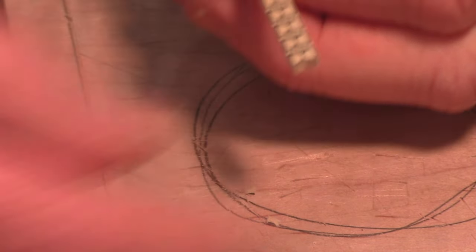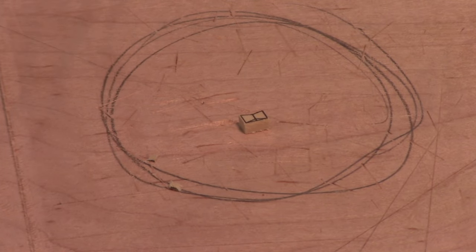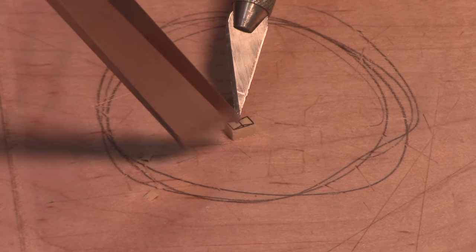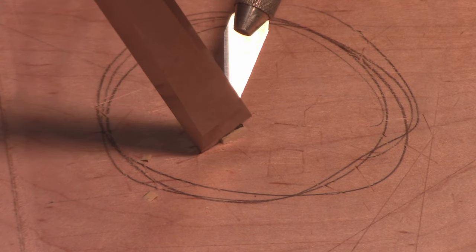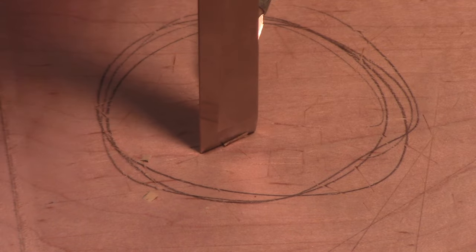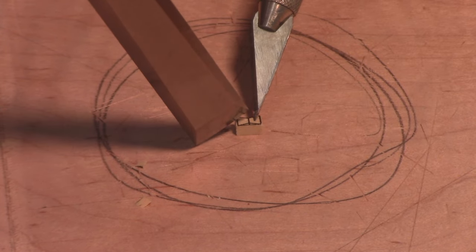So I've cut the notch. Now I'm going to take this to my trim board. Now I have a small piece of holly and there's no way I'm going to hold this with my finger, so what I like to do is take the point of an exacto knife — it can be whatever you choose. I'll repeat the process here, moving the piece around. I'll anchor the chisel in the hardwood and go across just like I did on the other side, point to point. Then I'll shear that off point to point and repeat the process to go from the point to the neck.